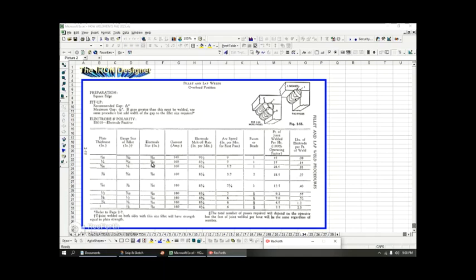So you can on your own compute 3/16 electrode diameter, 8.25 inches per minute, okay, and compute at this arc speed of 7 inches per minute on the pass. So this is melt rate, speed of the arc, and compute if that adds up to 0.14. All right, usually for steel density, I use 0.283 pounds per cubic inch.